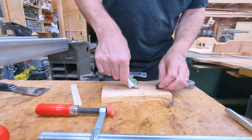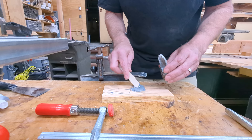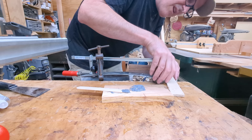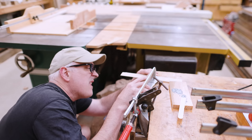There's a blade guard — at least I think that's what it is — that I found in a box of tidbits that came with the saw. It was broken into two pieces. The first thing I'm going to try is epoxying the two pieces back together. If that doesn't work, my next idea would be to make an aluminum plate to go between the two pieces and patch them together. If that doesn't work, the last attempt would be to remake this guard out of wood or design some new kind of guard for the blade. It was a little bit tricky clamping the two pieces together, but I came up with something that worked with two clamps and a shim.